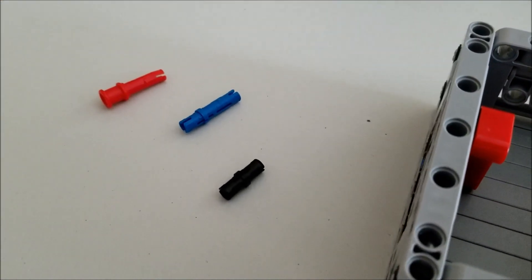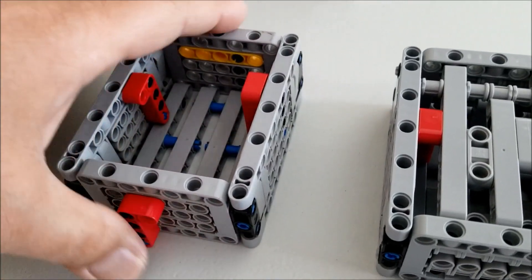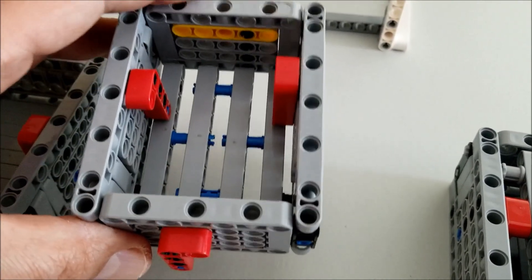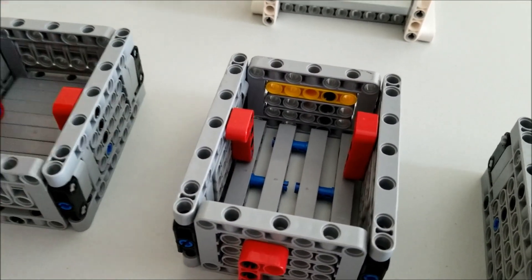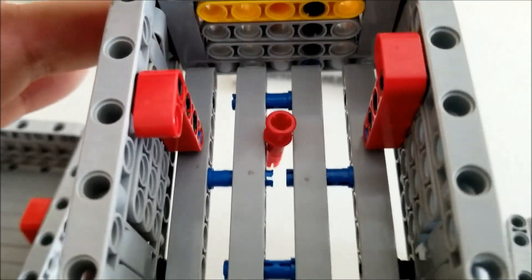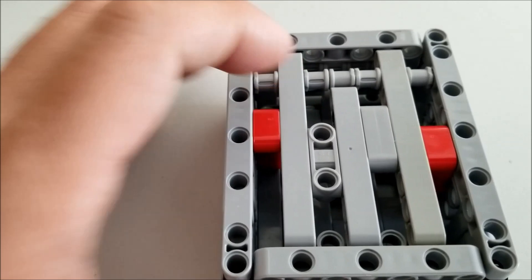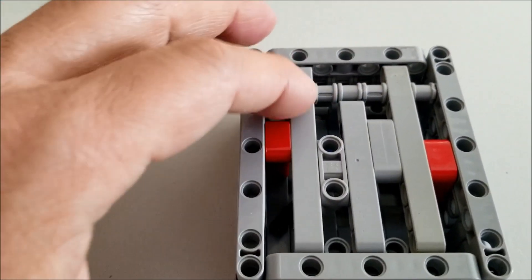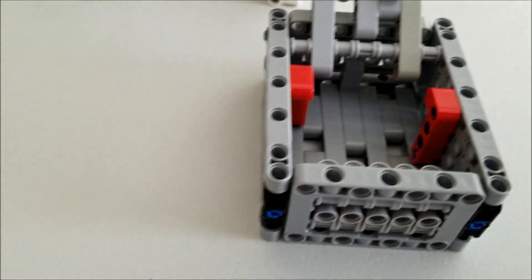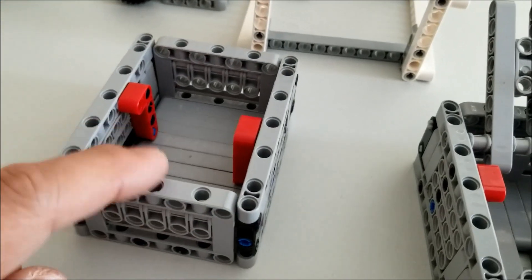Basically what's going to happen is we're going to be sorting these three pins: the red, the long blue, and the black. They're all going to get dumped into this one top compartment. You can see how everything gets a little bit smaller the farther down we go. So everything should fall through except the red pin — the space just doesn't allow that top part to go through. Then the next one has a little trap door, where the blue and the black should fall through. But the holes get smaller, so the black ones should be the only ones that fall through into the bottom tray.